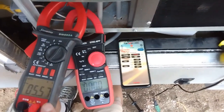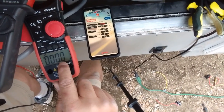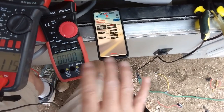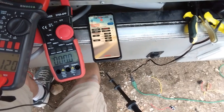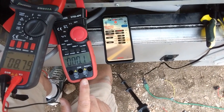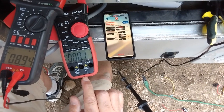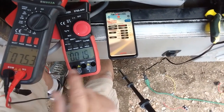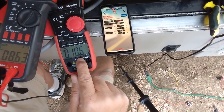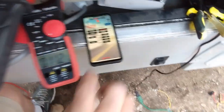5 amps. That's all I got on startup on that one. Let's see what this one says. It's crazy low. Like I said, it takes 5 times, and it keeps coming down. Alright, here we go. This one going off pretty soon. Pulling 1500 watts almost. Running amps is 9 over here. Oh, the compressor's kicking on. It goes to high speed on the fan too. 11 amps was the peak. 2600 watts.